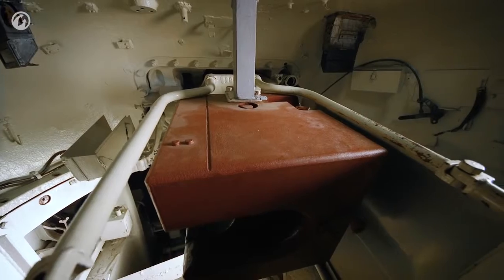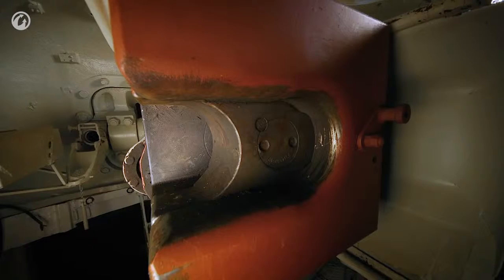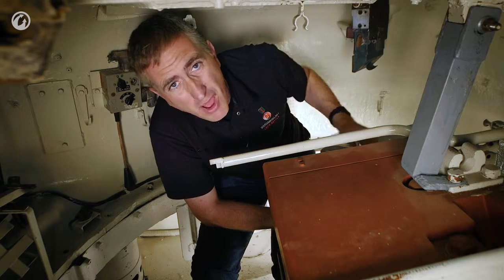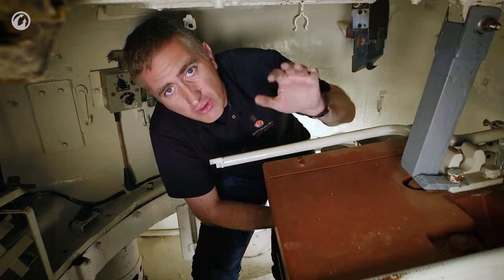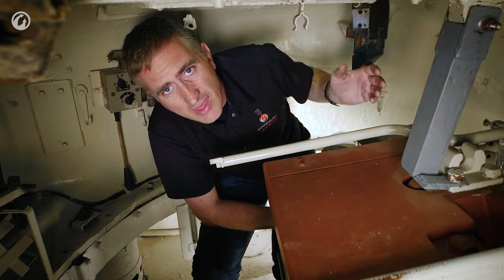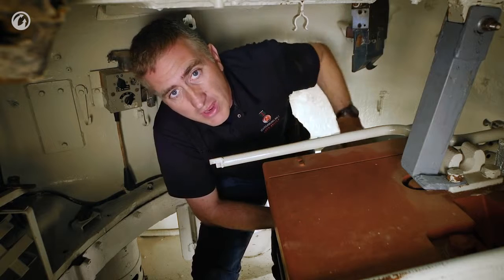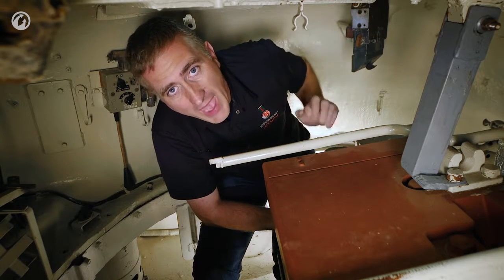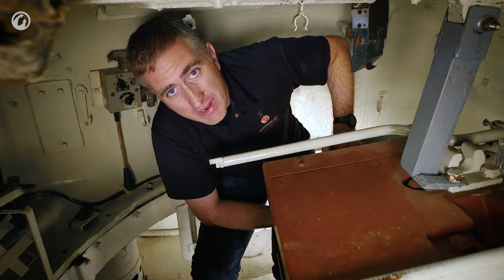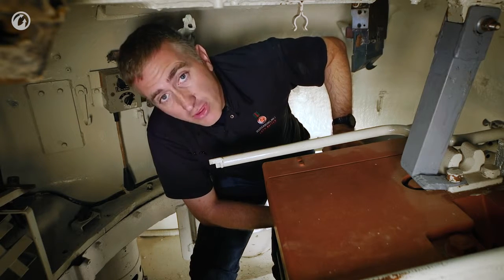Say you have three AP and two HE rounds — fire off your two HE rounds and you're looking around for long-term stowage. 77 rounds were available in the vehicle: five in the ready rack, another 18 forward under the turret backing the driver, 40 more on the right-hand side under the turret — relatively inaccessible — and the final 14 in the former bow gunner's position. Although possible to pull most of those out through the bow gunner's position back into the loader's position with the turret spun around, it was usually easier to climb out and lift them up through the hatch and down into the turret. This is the price you pay for putting a very powerful gun into a really small turret.